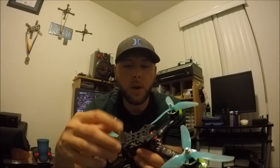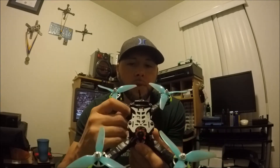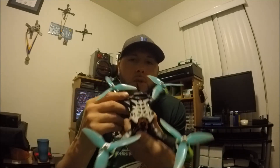That's another really cool thing about F7 boards in general — and that should apply to any F7 board, though this is the first one I've tried. Overall I'm super impressed with it. It flew really well today, seems very responsive, and having the altitude readout is just awesome. We're going to cut to the flight footage so you can check it out. You'll be able to see the altitude in the upper right corner of the OSD displayed in meters, and you can actually see how high I go up to the 120 meter mark. I do a look around at that point so you can see the view from that height.